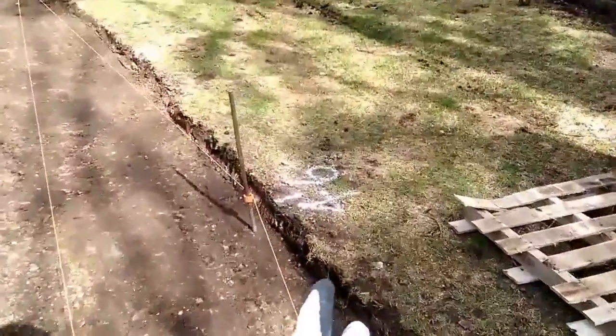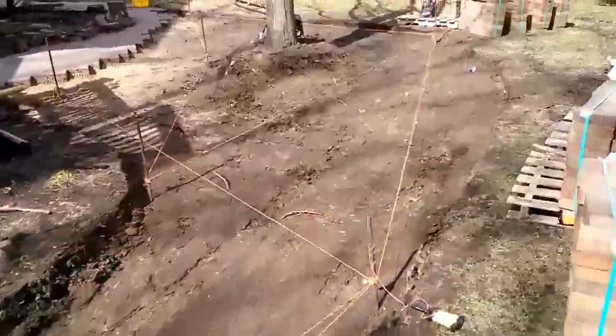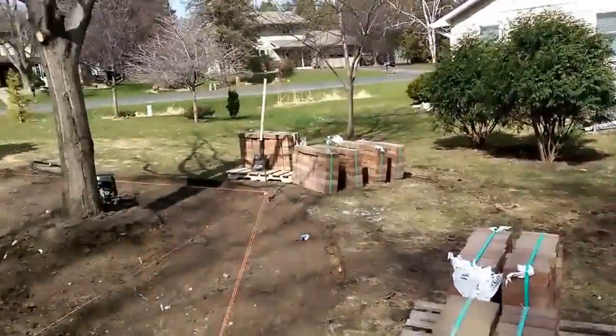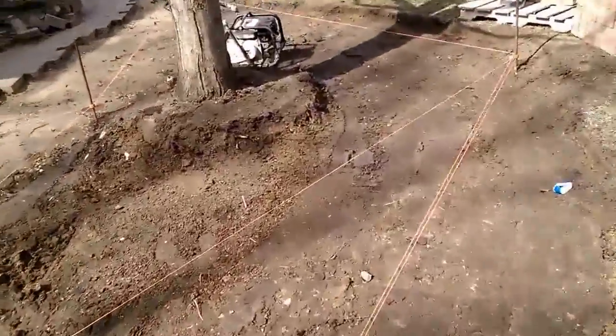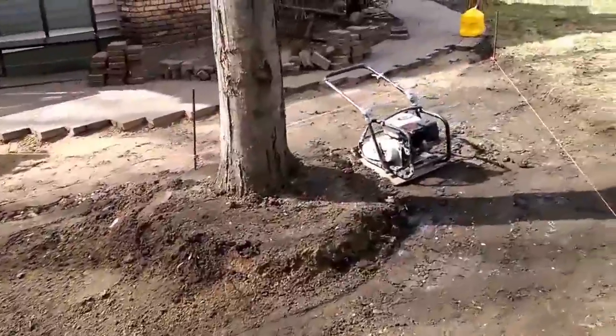So we are at 4.6 here, 2 inches lower than the place I just showed you. Everything is stringed up here. I don't have marks, but I do know my paver measurements over there out to the street. So that's where the watershed goes. The same exact path that I just walked is the watershed. So all this is going to patch up to our existing pavers that have been patched out.